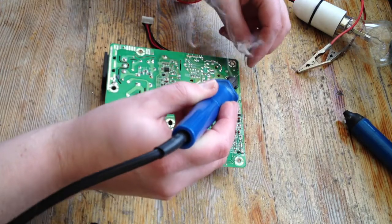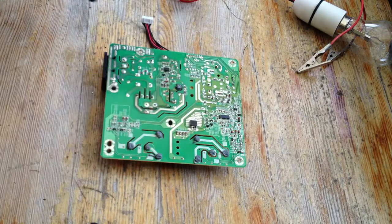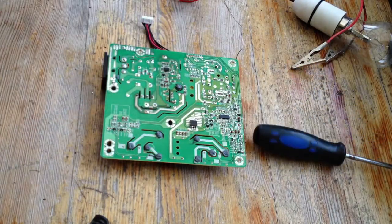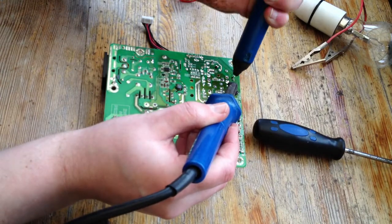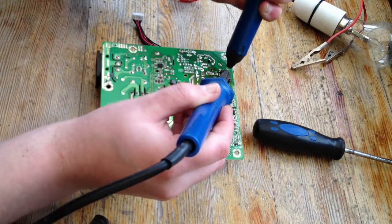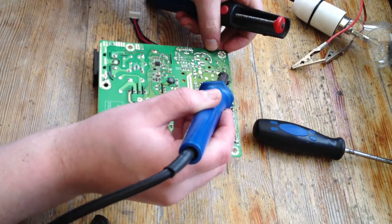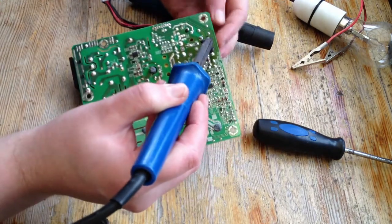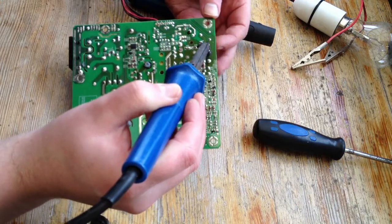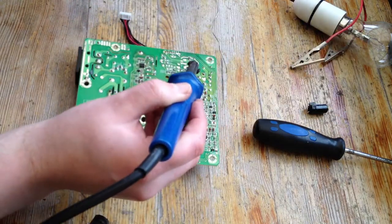Normally the easiest way to desolder is to feed in a bit of fresh solder first, which helps you melt the existing solder. I apologize for not zooming in closer — I didn't have the capability at the time. What I'm doing is heating it with my soldering iron and then using a solder sucker to remove the solder. It's a very good skill to be adept at. If you do it cleanly, you need just two passes to clear the solder from the two leads. Then I heat both sides and gently work the capacitor out with my fingers, and there's the first one out.